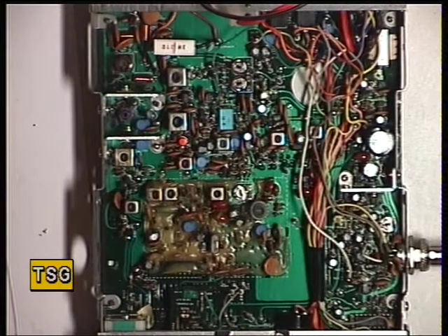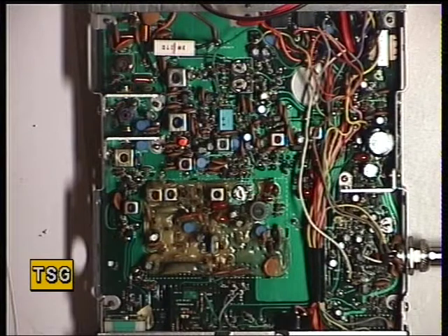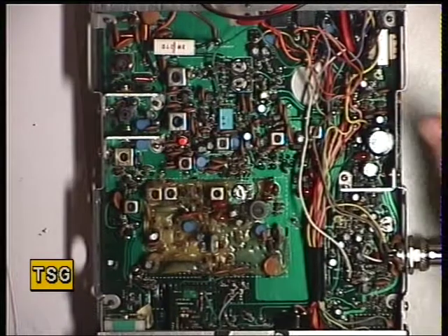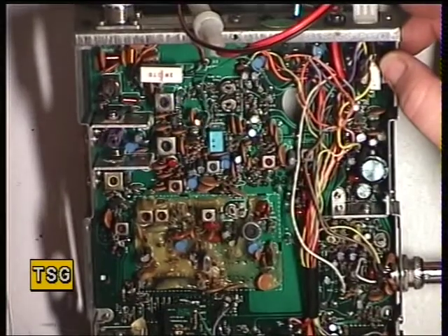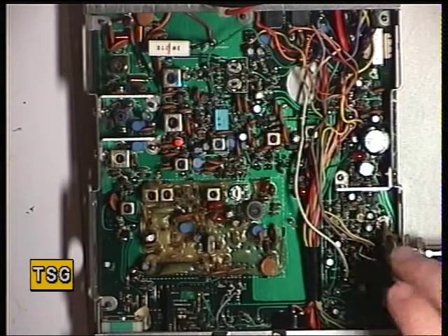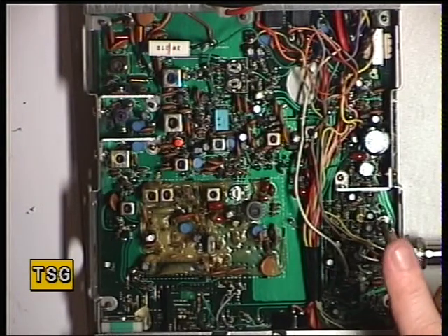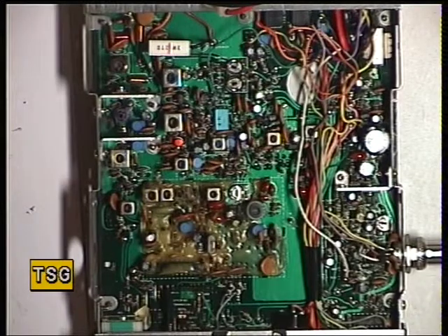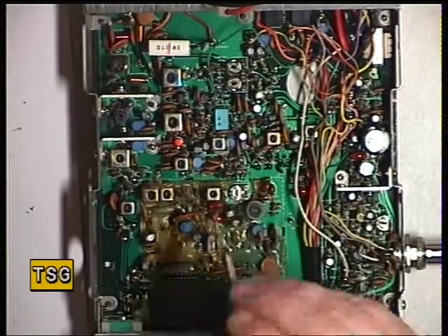Not sure if there's a low power preset on these sets — I'll just go into low power. It's 0.3; I'd like it to have been 0.4 but I'm not sure there's a preset. There isn't a low power setting on these. While we're talking about the transmitter: what you do have is an automatic level control for the microphone, which is effectively mic gain. You don't want that at full by any means — in a mobile situation you'd end up with nothing but road noise, so that and the deviation is how it's set up.